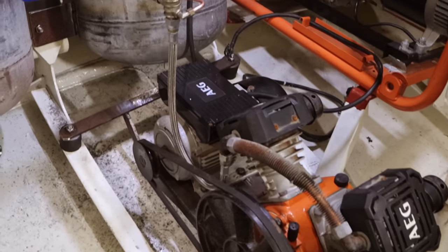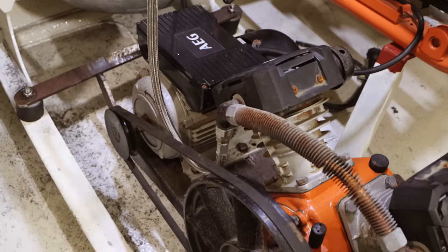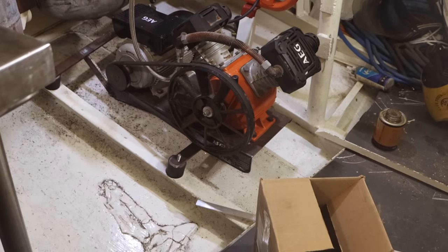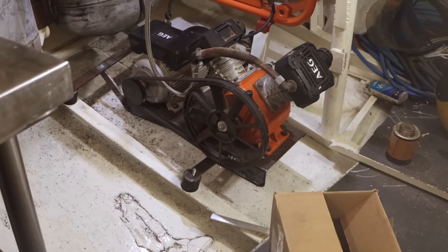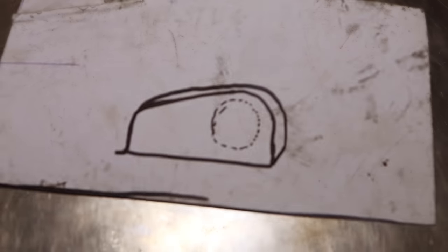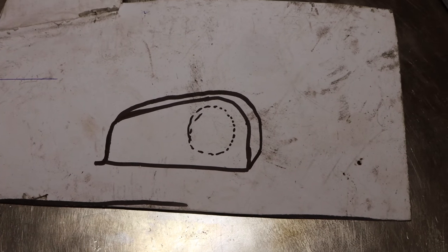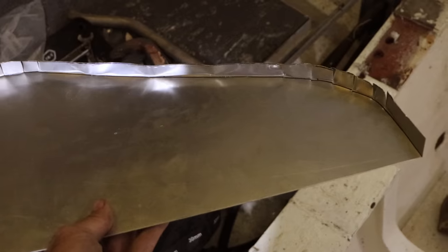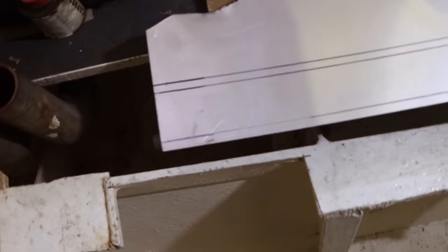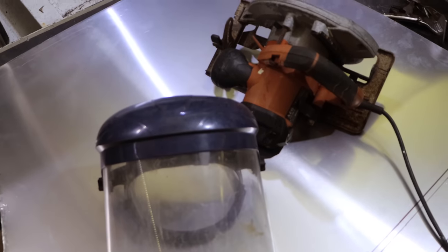I've done another town run and I've got a piece of stainless flex going between this solid mount and down to the fitting on the compressor itself. But I need to make this fan at the front end of the compressor safe — I need to put a grate on the guard that I've built so that the air can get through and fingers can't. I don't often build things to a plan, and this isn't probably what most people would think of as a plan, but it is for me — a life-size mock-up in cardboard and then we have the aluminium version. I need to cut a strip out using the skill saw, and I'm going to do it in the engine room because it's way too wet to try it outside.